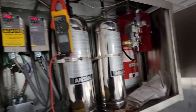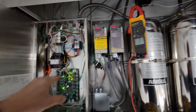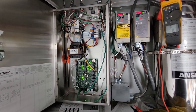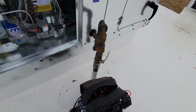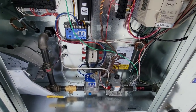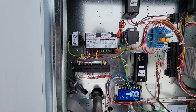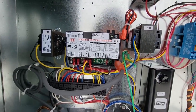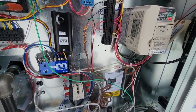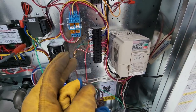That's more normal. Let's go up and see if we can get the gas running. All the settings — fan speeds, fire setpoints — all that has to be done by the certified people. We just need to make sure it runs for them. We checked the gas — it was obviously off, so we got it on, bled it at the union. You could smell it coming through. I think it may have locked out but I couldn't see anything blinking.